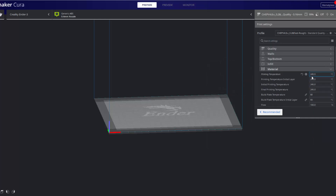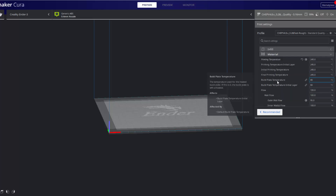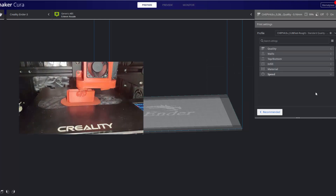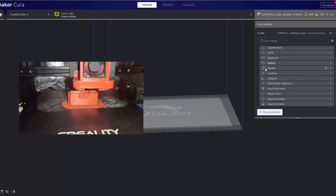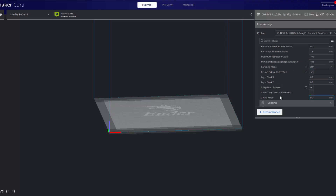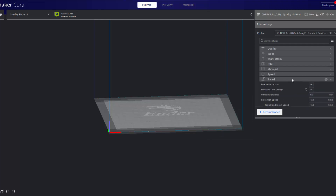So this is important. For material temperature, I like to print at 245°C but you can print hotter — I don't typically go below 245 degrees. 245 degrees gives me good layer adhesion and good strength. For the bed build plate, I like to print at 80 to 100°C. For this demonstration I printed at 80°C and it seemed to stick just fine. Speed doesn't really matter too much — I like to print at 60 millimeters a second. For travel, enable retraction and retracted layer change; those work very well. Make sure to click Z hop when retracted. For cooling, turn that off — any cooling will result in very weak parts in my experience, so I typically don't print with a cooling fan on when printing ABS.